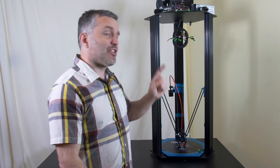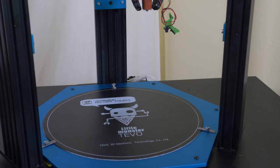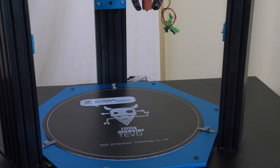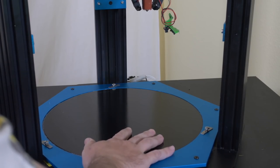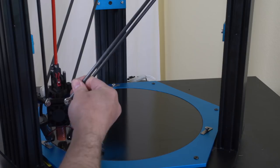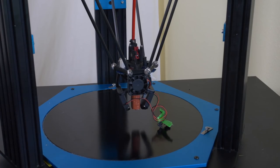The physical build is complete and it's looking good. Starting with the bed: I've got the Build Tack that came with the printer and the PEI flexible print surface, and I can replace those if one fails. I can also print on the underlying glass print bed. There is an issue where the part cooling fan at the far edge can collide with the thumb screws, but if I'm printing on the glass I can just remove the thumb screws and avoid that issue.